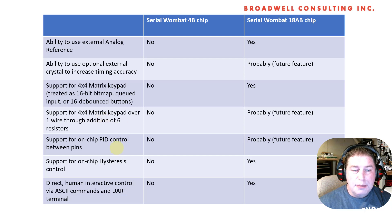The Serial Wombat 18AB chip is going to be much smarter in terms of being able to offload controls-type functionality from the Arduino board. For instance, PID control will be available shortly after launch — you'll be able to download P, I, and D constants and say: take the analog input on pin two with this set of constants, sample at 20 hertz, and drive the PID output into the PWM on pin 17. You set your target, such as 1700 counts on the A-to-D, and the chip runs the PID controller accordingly. You can even unplug the Arduino and the Serial Wombat chip will continue real-time control — useful for robotics, animatronics, and model railroading.